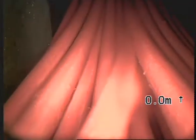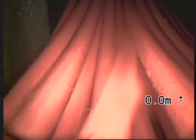We're in the gully branch now, pulling out the gully trap to show you again where we're camering from. There's the gully. Toilet's behind that bin in the house there in that window. Drain runs that way and then across the house there. So stop recording here and try and plunge the toilet to clear the blockage.